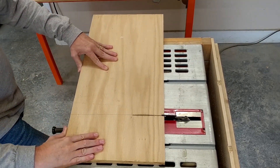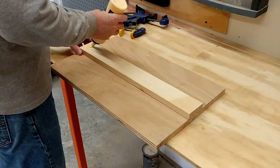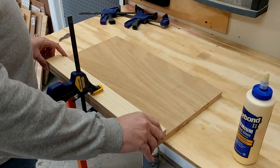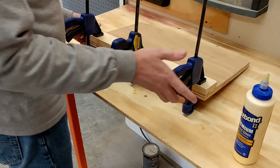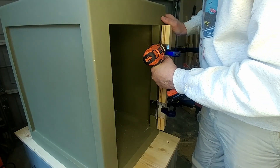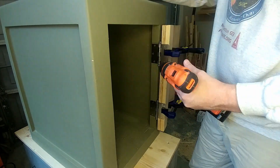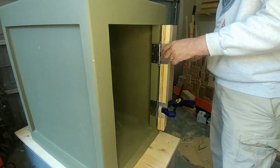We're using scraps? Ha! That's what we do here. Half-inch plywood is not thick enough to support the hinge depth that we have, so an extra strip was added to increase thickness and give the hinges something to screw into. Then the door was test mounted on the hinges, clamps holding it in place until the screws could be put in. Care was taken to leave some space around the edges to account for primer and paint when the safe door eventually was painted.